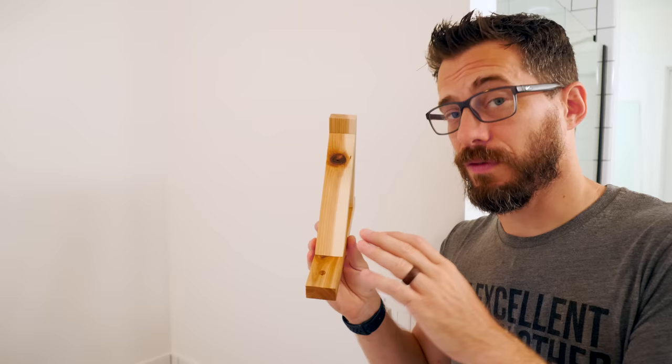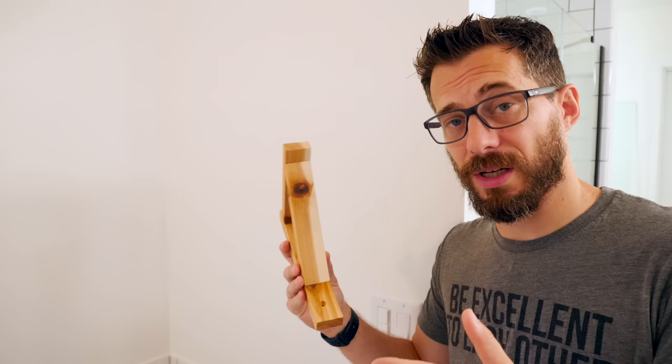And lastly, we're gonna put the shelves on the wall. For the finish on these, I did several coats of spray lacquer with a light sanding in between the first couple of coats. These aren't gonna come in contact with water, just the humidity in the room. So they may expand, they may change shape a little bit over time, but they won't get soaked in water like the other pieces might.